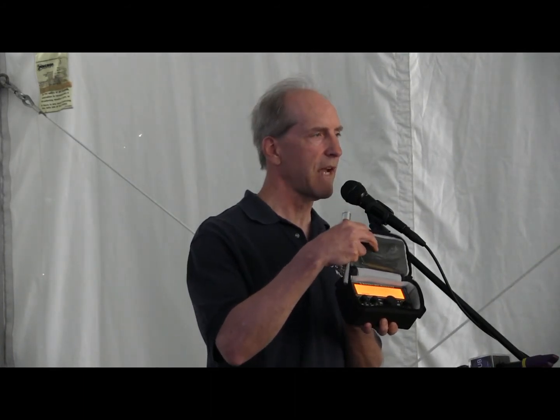It's got a nice large backlit display and it'll run up to 12 watts. It is a software defined radio, but it's also very low current drain — only 150 milliamps. We needed an antenna small enough to go with this radio inside this very small bag. This is our CS40 bag. I've got the keyer paddle inside that attaches to the rig, an Apple EarPod I use as my headphone and mic interface, and a paper log sheet. I basically go out in the field like my SOTA customers and try to operate with low power and small antennas.